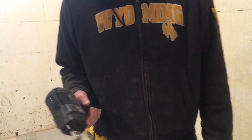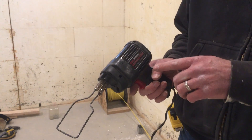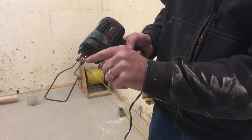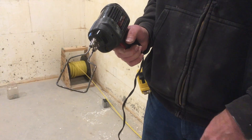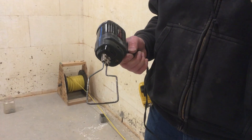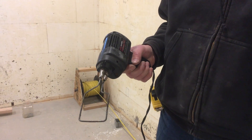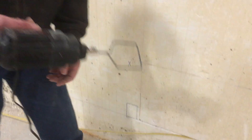Another thing is a homemade tool. You'll see these for hundreds of dollars. This is a Sears soldering gun that I think was $14 about 15 years ago. It normally has a tip out here for soldering. I took these screws out, took the soldering tip out, took a piece of number nine wire, and bent it the shape and size I wanted — and spent nothing. You just use stuff laying around, and even if you don't have this stuff, it's pretty inexpensive compared to the tools you can buy that do this same thing but cost hundreds of dollars. I'll show you how I use that here in a minute.